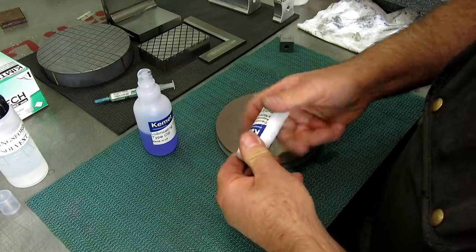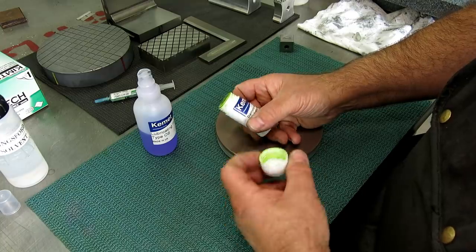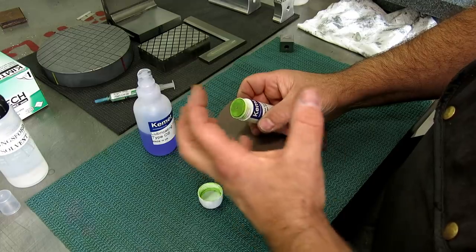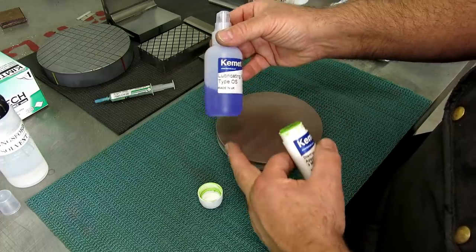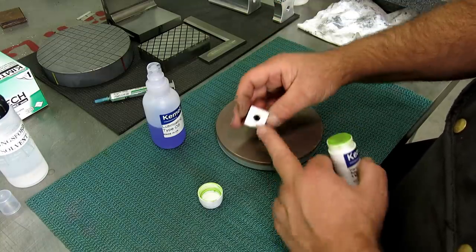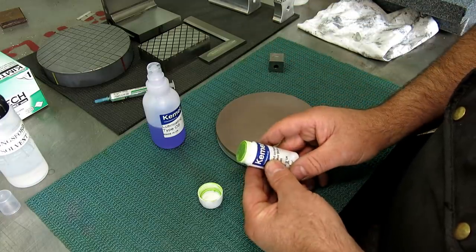So this is the diamond — it's kind of like a deodorant dispenser. You crank this and it's a waxy carrier. Not recommended for daily use. What's nice about this is the diamond distribution in this waxy carrier is uniform throughout — where if you have a liquid suspension, generally it falls out of suspension and you have to continually stir it. So this is really nice for that. I got a little sample piece here — this is actually soft steel, just done on the surface plate on a little bit of abrasive paper. We'll lap the end of that a little bit just as a quick demo using the three micron.